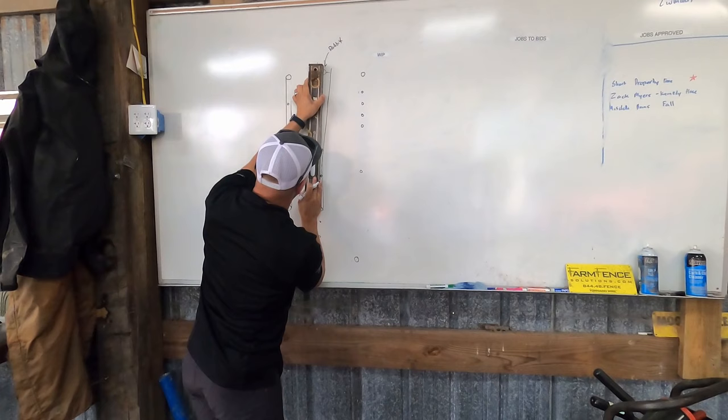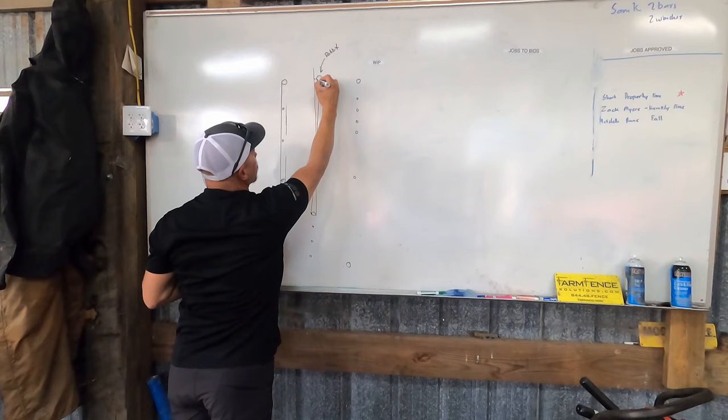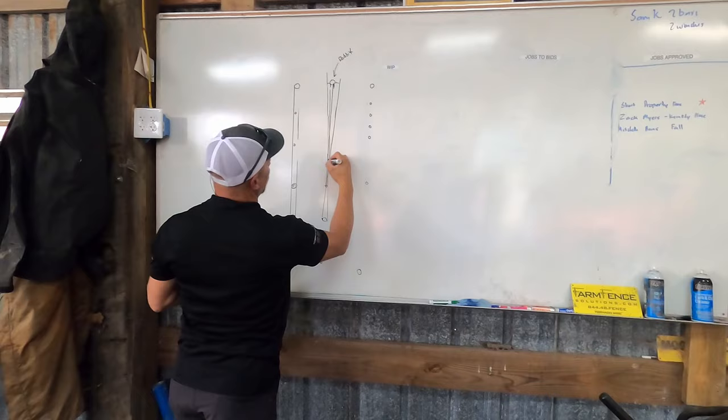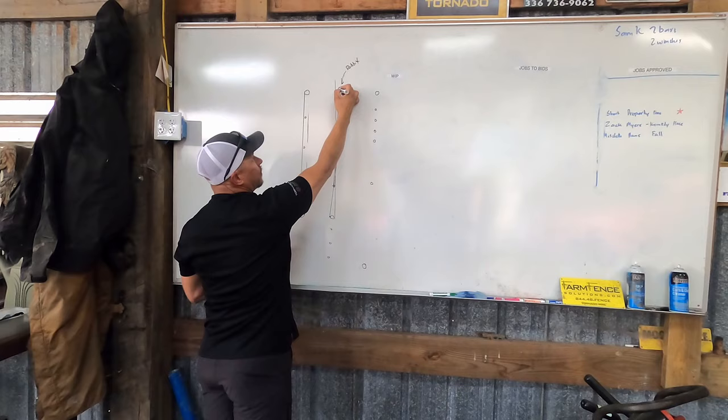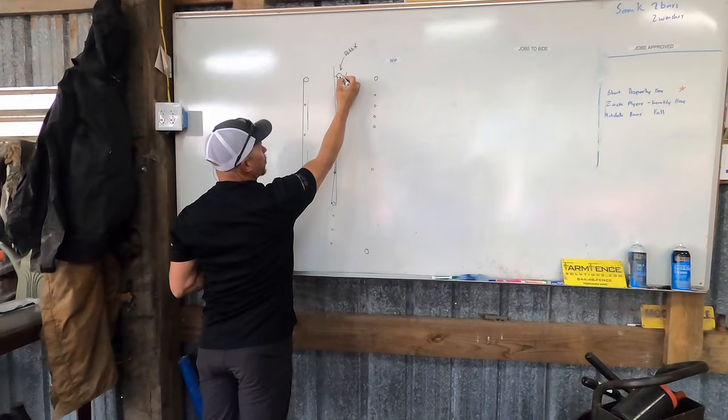When sighting down both sides of the two smaller line posts, no matter which side you look off, you'll see a line that runs directly into that rabbit post. If we wrap the rabbit post in orange flagging tape, we want to see the same amount of post — the same amount of flagging — on both sides. That tells us we're still headed for that terminal post.